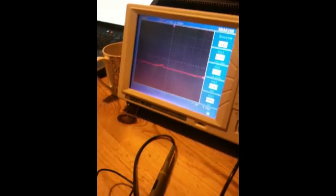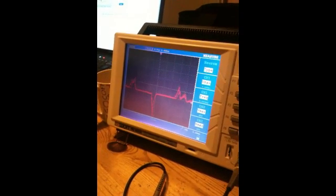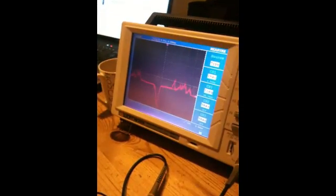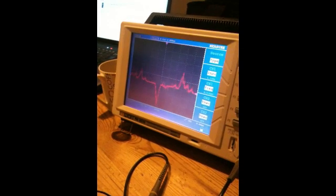So let's connect this up to the oscilloscope and have a look. The oscilloscope is set on a scale of 1 volt. I'll just connect both of the wires up. Now we have a look at the oscilloscope, and we'll move the actual buzzer itself. Here we can see we're almost up to 2 volts - 1.4, 1.7.